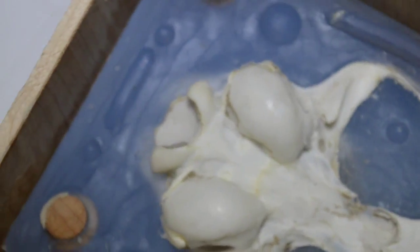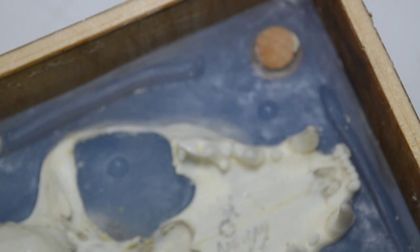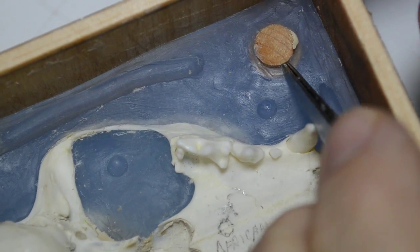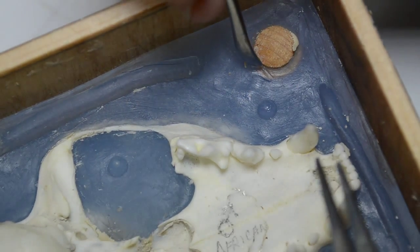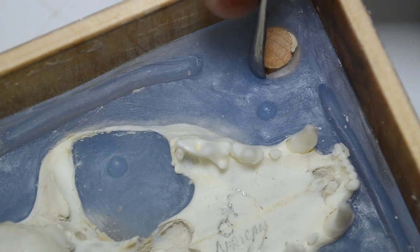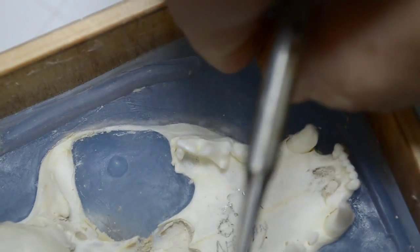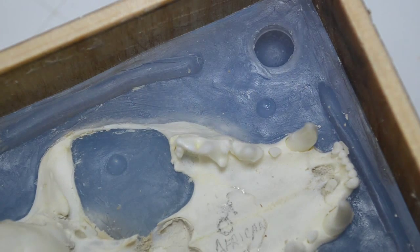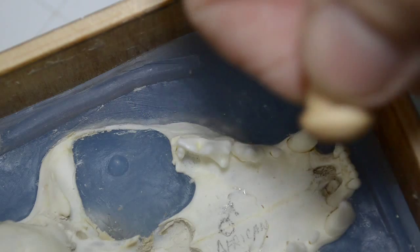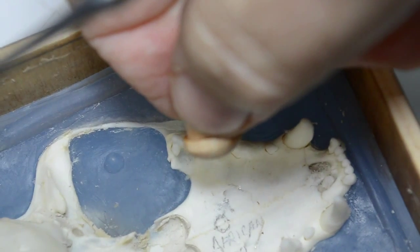Okay, all right. Well, let's go ahead and finish prepping out this mold. The other things that need to be done is these wooden corner keys here need to be removed. The best way to do that is, let me clean the clay off my modeling tool. There we are. I get in like so, and I just pop them out. Now, I don't see any air bubbles in here or under the lip, the top of that mushroom-like top on these little nubbins here.